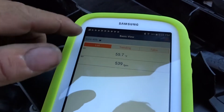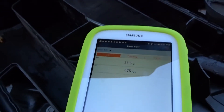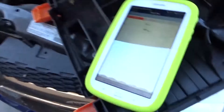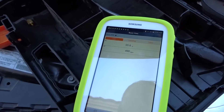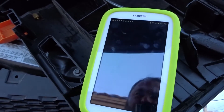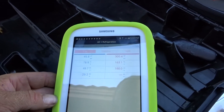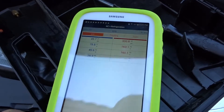I'll close the app and restart it. Yeah, it got it — so it's blowing about 55 to 56 degree air. I'm probably not going to add any more refrigerant; I just added a couple of ounces because it probably lost a couple over almost four years. High side is at 300 PSI, which is pretty typical here in Arizona.